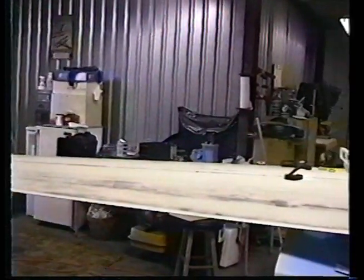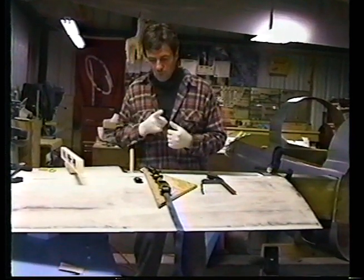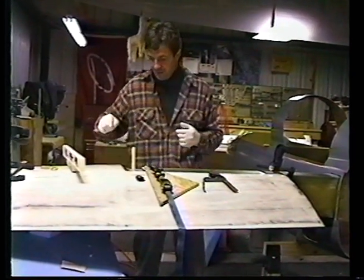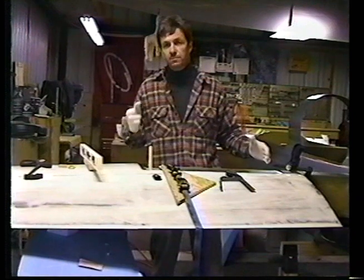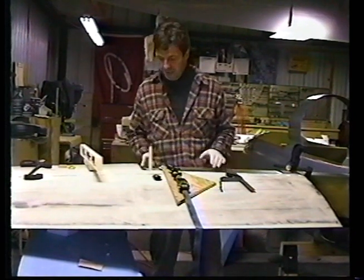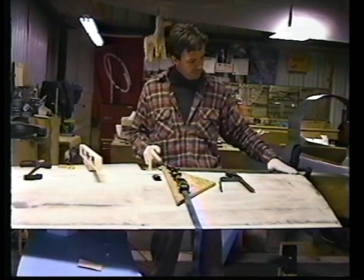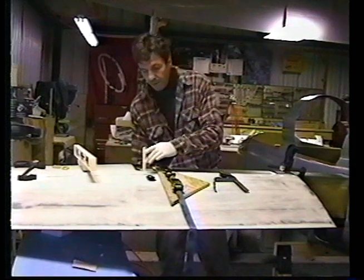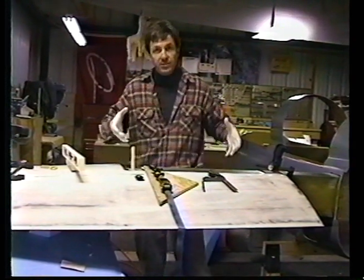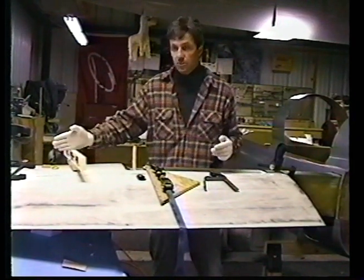Now, the next most important reference is the one we haven't talked about yet. We have one more prime consideration here in this equation, and that's the relationship of the spar to the wing itself. There is a variation from wing to wing. The spars are all the same. Same width at the tip on both ends, same thickness, of course, in the center. But what we're going to have different is from wing to wing, they're going to be a little thicker or thinner inboard, a little thicker or thinner at this station. So we have some averaging to do, not only with these two dimensions at the trailing edge. We have the incidence we have to have correct.